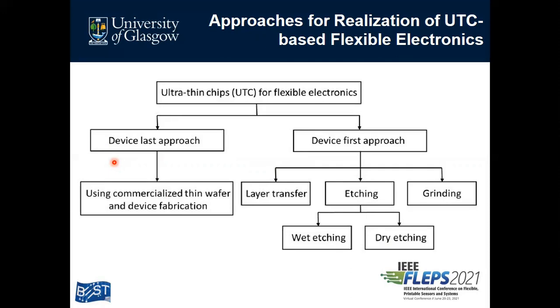Here I am going to discuss the grinding technique, namely back-side lapping — thinning the back side of the wafer. This is a very simple process; it is not time-consuming, and it is cost-effective. In the coming presentation, I will show the fabrication process of a CMOS-compatible piezoelectric pressure sensor and its thinning, and finally the results will be discussed.